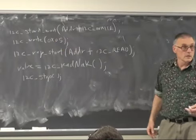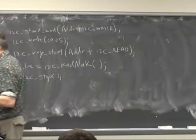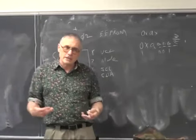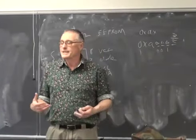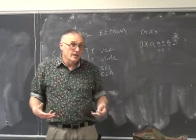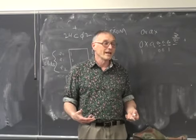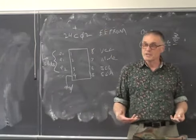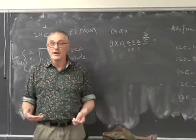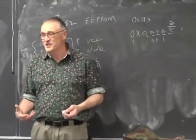It depends on the device. That's completely device dependent. And my next sentence, when you held up your hand, was going to be that the hardest part of this is reading the data sheet for the device you're going to control, because it itself is some complicated state machine that goes through a whole bunch of gyrations. A ROM is pretty easy. You can read from a spot, you can write to a spot. How about a video camera where you could read any spot on the image? Or you could start a new acquisition of an image, or stop an image, or do one line of an image. And so then you have a very complicated state machine with lots of commands. And the hard part of this is to understand the device you're controlling over the bus.